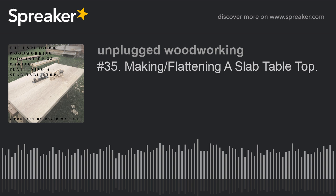So on the first slab I'd done, there was twist, so obviously I did have to do a little bit extra on it. The second slab, however, I basically got away with; it might have been a bit of a fluke, but I didn't have any twist to take out of it. The two initial pencil lines that I marked in and worked from worked out really well for me. With the first slab, I did have to take away a little bit of twist, which just involved hitting two corners. The corner furthest away from me, I had to take more off, whereas the corner closest to myself didn't seem to need too much. So a little bit extra work on that.